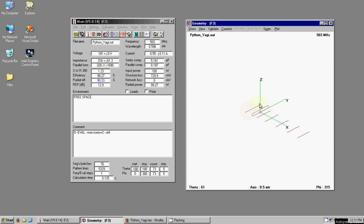Basically what happens is, the signal comes from this direction along the X-axis, and all of these directors you could basically think of as focusing the RF energy onto the folded dipole — this is the only one actually connected to the wire that runs to your TV. The reflector reflects energy that has passed back onto the dipole, and also helps block signal coming from behind the antenna.